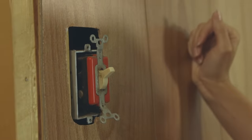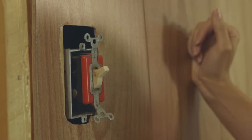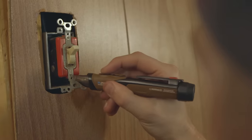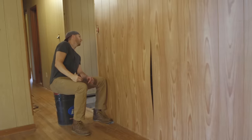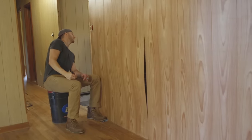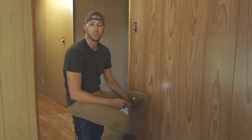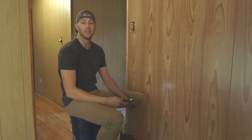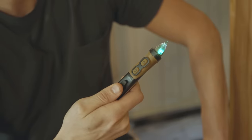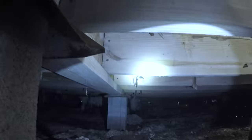What about this light switch — there's got to be wires in the wall. To see if this light switch is live, we're going to use a voltage detector. Just touch the pin to the switch or outlet, and if it lights up and beeps, the wires are hot. Ashley, cut the power to the light switch please. Now that the power is off, we put the voltage tester back on the switch — if it stays green, the outlet is safe to work with. You can find one of these voltage testers at your local Lowe's home improvement store.